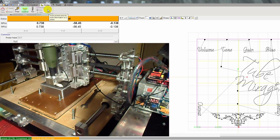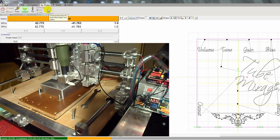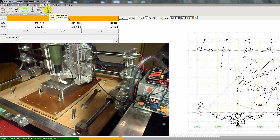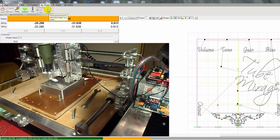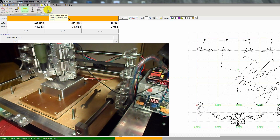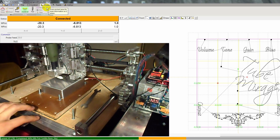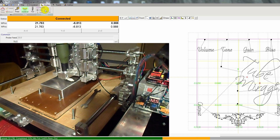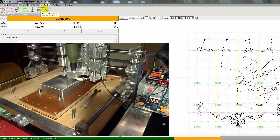There are a number of reasons why you would get a probe error at this point. It's always best to use a 100 nF capacitor between the leads if you're using an Arduino system like I am — that will prevent any spikes from occurring. Also, my power supply over there is not touching the frame. You see the frame is partly metallic, and that's really important because I used to get sparks and burn a lot of Arduinos this way.